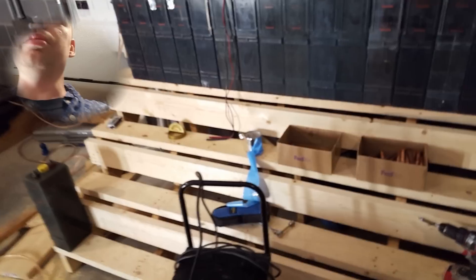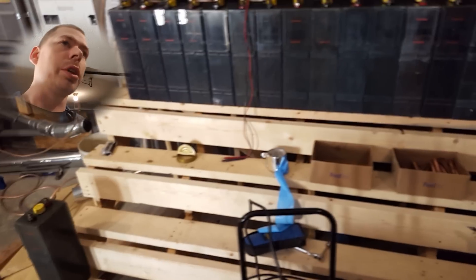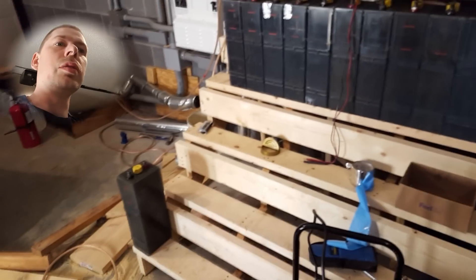I'm still running right now off these batteries, trying to discharge them. I'm losing about four volts because of those five bad batteries, and four volts in a 48-volt system is enough to cause a premature shutdown. I've got to get all these replaced with functional batteries.